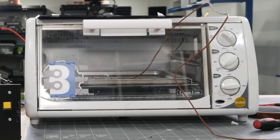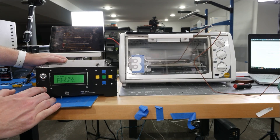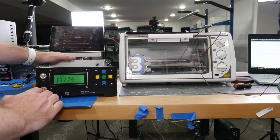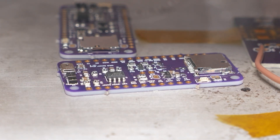For soldering, I have a super advanced reflow oven with a custom controller based on a solid-state relay. For SOIC and 0805 footprints, this setup works really well. I normally use it with bismuth solder which has a low melting point. Despite being a crude method, I still get to watch the magic surface mount reflow action happen. The biggest downside to my DIY approach is I almost always have to do rework on every single one of the boards.